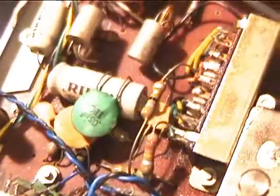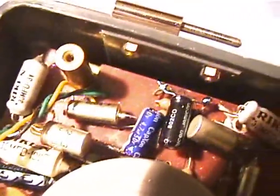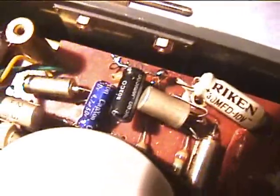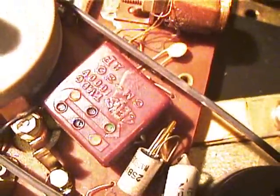You also see the classic vintage circuitry inside it. Germanium transistors. There's one of the capacitors I replaced right there. Another one right there. Another one right there, and another shiny one right there. Another one there, and another shiny one there. And right there is the AC bias coil. There's even an old mica capacitor in there. I think it's for the bias oscillator.